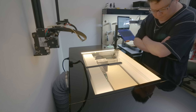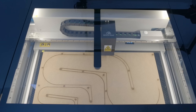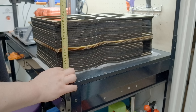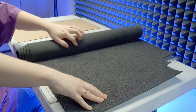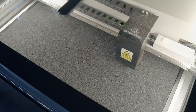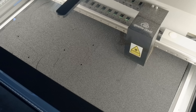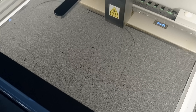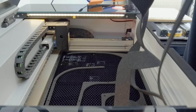Given the sheer speed at which the laser cut through all that MDF, I decided to double the fun and build a pair of these — so that's 19 centimeters of MDF and acrylic cut through in the span of a weekend. The last thing on the chopping block is a roll of closed-cell foam, another polymer, and even at minimum power everything is cut in just a few minutes. If you want perfect air seals to line your see-through panels or gaskets to go around the back of a driver, a CO2 laser like this is the perfect tool for the job.